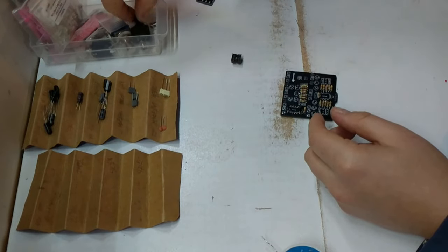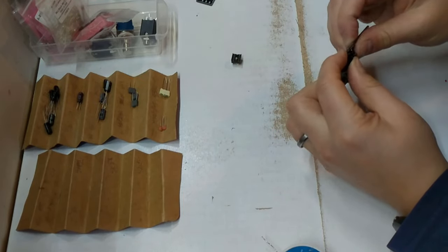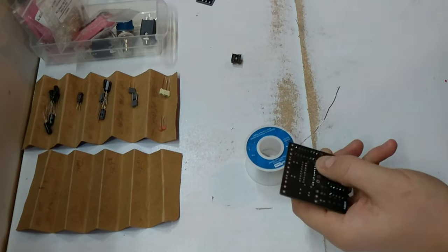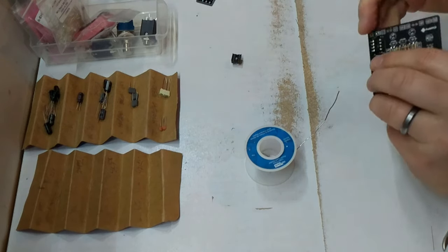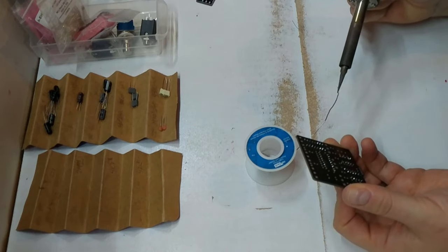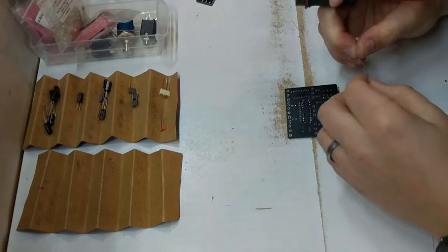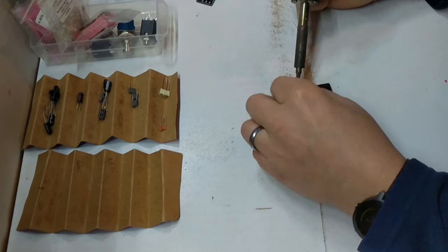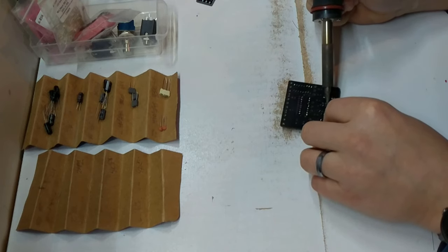Same way as your resistors. Diodes are in now. The next lowest thing is not the capacitors even though some people might think that — it's actually my sockets for my ICs, so I'm going to put those in next. The easiest way to put those in is to get a little bit of solder on your soldering iron and tack one leg down, and I'll do that with the other one as well. Then just go back over each of the eight legs to make sure they're all soldered in tightly. You want to go back over the one you just tacked as well because sometimes that is a cold solder joint — but get a few legs down first before you go ahead with that.